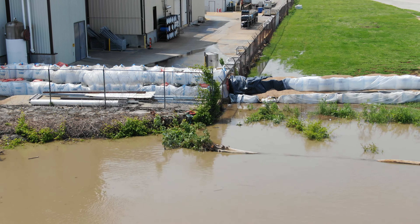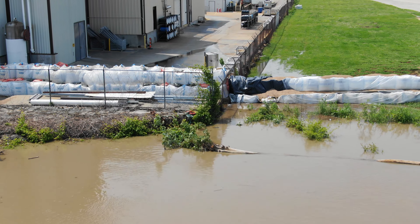Other people think of big bags, super sacks, jumbo sacks, or single bags. They all round out when filled, so when you put a circle next to a circle next to a circle, there are voids in the middle of them all. Ours are squared off and maximize the surface tension between the bags, so there are far fewer voids. If you stack them like brick or block and don't line up the seams on your bottom course, that gives you even more force protection against the flow of water.